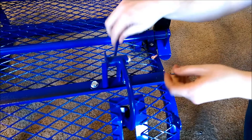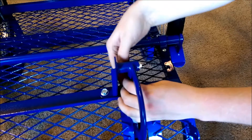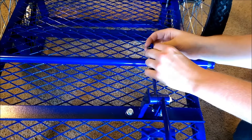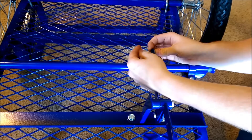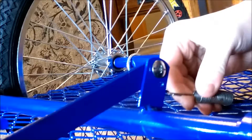Find the support bar with the three pre-drilled holes. Place the three holes towards the front of the cart under the pivot bar. You can adjust the length of the support bar using the three holes and the pre-included bolt and nut. Now attach your support bar to the peg on the brake bar using the included bolt and nut. Fasten this bolt down pretty tight, but be sure to leave a little wiggle room so the brake will still be able to move. Now grab your spring and place one end in the pre-drilled hole on the frame and one end in the hole on the peg on the brake bar.